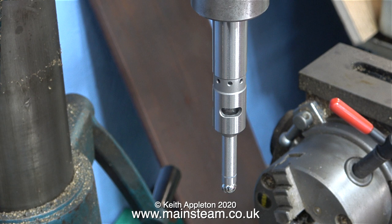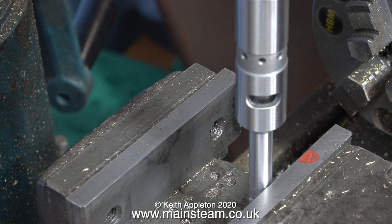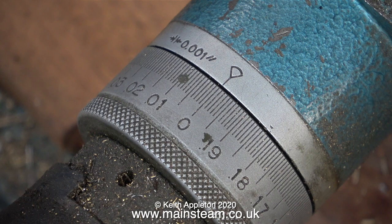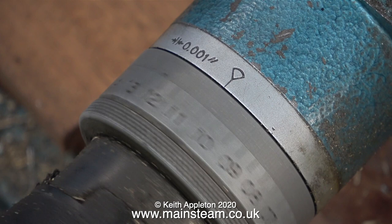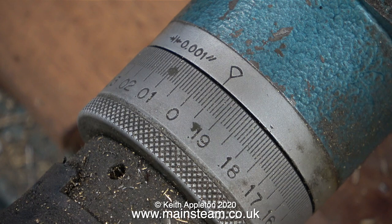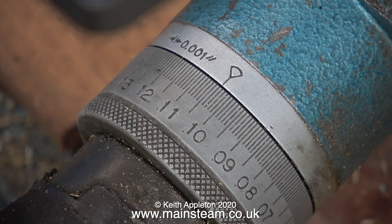You have to be careful here not to be too heavy handed. I'm turning the handle that moves the table very gently and very slowly, and as soon as I hear this noise I stop. This edge finder is very sensitive and you need to make sure that the light is glowing at full brightness. The next thing to do is to zero the hand wheel. This is an imperial machine and each one of the gaps equals one thousandth of an inch. It's a better idea to wind this wheel clockwise - I'm winding it anti-clockwise so the numbers are all in a negative value, but it doesn't really matter. I'm going to make a note of these numbers, then re-zero the hand wheel's vernier and wind the handle in the opposite direction to move the pointer of the edge finder back across to the first vice jaw where I started.